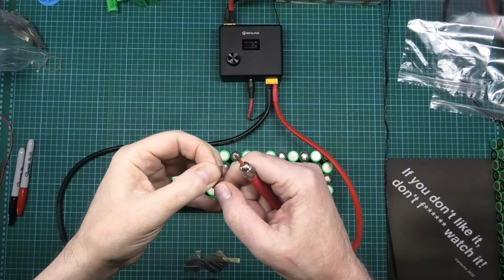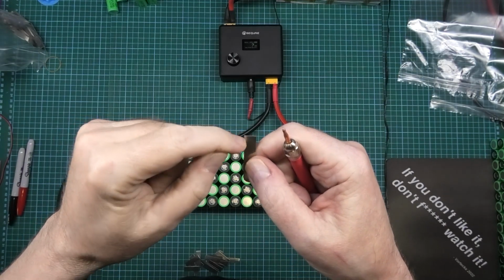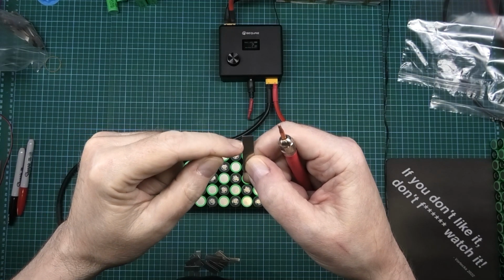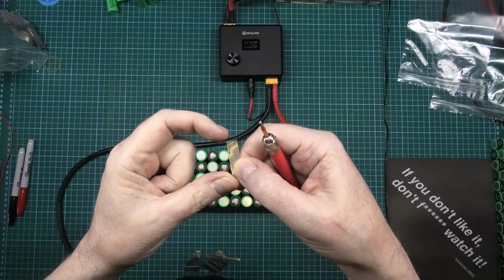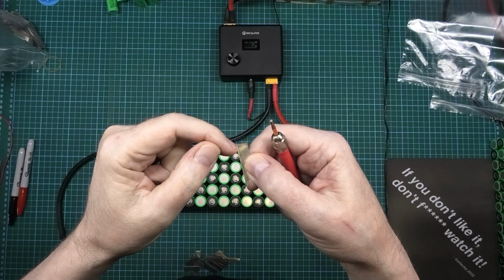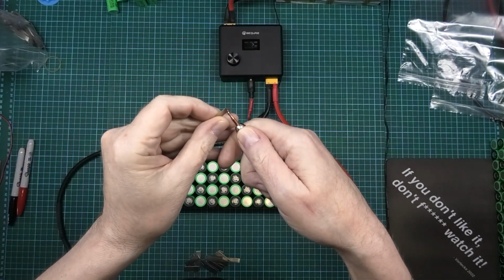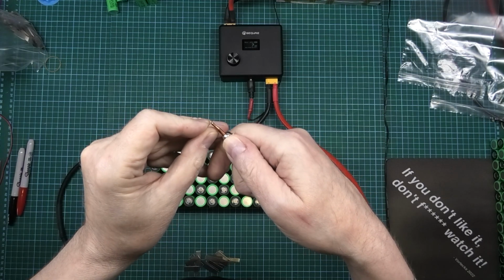If you sharpen the points on that and you put a spot weld on there and it's a millimeter square, you've got all the current running through that 1 millimeter, wherever the point of contact is where the current actually flows through. So you'll have 1 millimeter carrying all the current. If you've got blunt tips like this and you've got enough current, then it puts a far bigger spot weld and far better current handling.